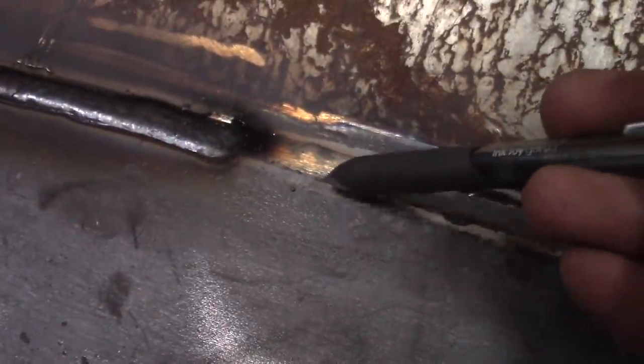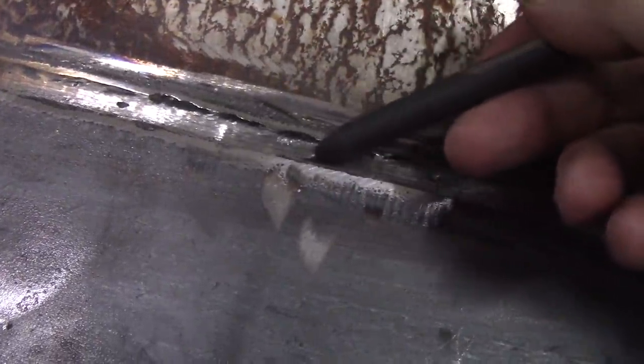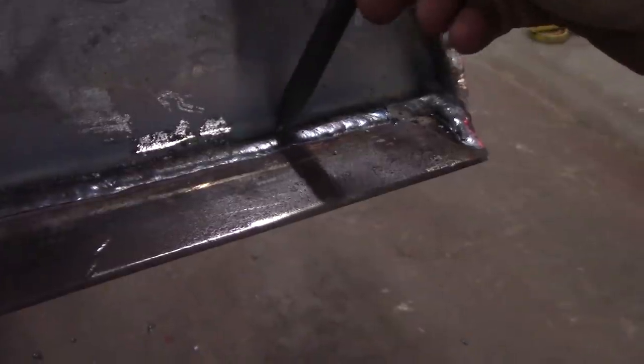I got one weld. I got a groove. I back-ground everything so it was nice and even. See, it's nice and flush here too. But in this position, I'm gonna lay a bead right on here, because this root wasn't the best, so I decided to do a two pass rather than flood that whole thing and have it ugly. I'm gonna do another pass right up on here. Same with this one. This is your first pass of a three pass weld. The original one I cut out and ground back. So here there'll be a weld, then I can lay one right in here and she'll blend really nicely.